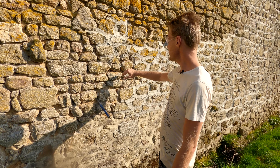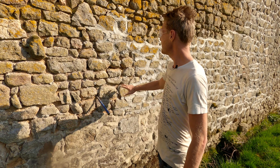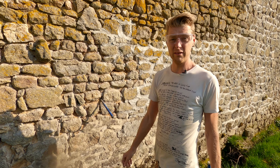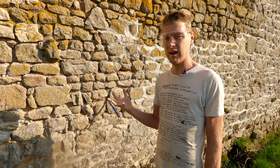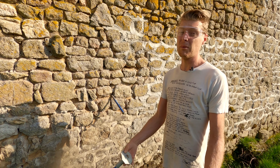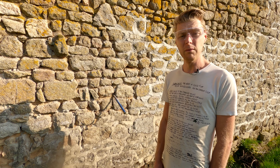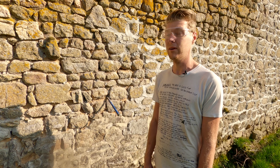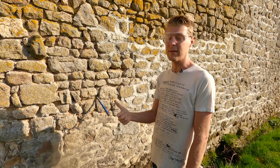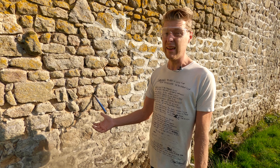This wall is made of nice crumbly lime, and this stuff is horrible grey cement. What we need to do is remove all of the horrible grey cement and replace it with new nice crumbly lime, because the lime is incredibly strong — in fact a lot stronger than the cement. As proof of that, not very far from me, there are Roman-built buildings that are over a millennia old. This place is about 450 years old, so it has done quite well. But anything made of lime mortar that has been around for a thousand years is doing incredibly well.